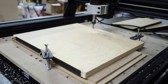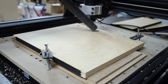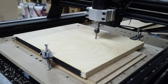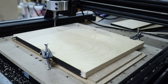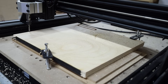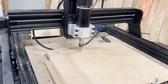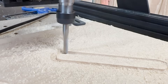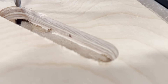Moving on with testing, I used these same settings on some plywood to make a little step stool for my daughter. After starting the cut I realized I hadn't set the bottom height correctly so it didn't cut all the way through. I tried stopping it to fix the bottom height but the machine started locking up on the Y axis and completely lost the previous origin. I did my best to get the bit back to the previous origin and kicked off the operation again — this time it went really well until it cut through the plywood and the offcut came loose and locked up the gantry.